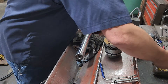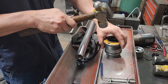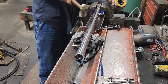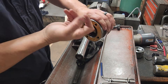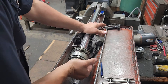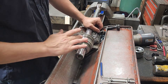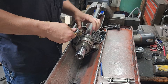Lastly is the wiper — we'll take and start it there and hammer and work it all the way around. After all that's done, we'll get some grease and put it in the gland. Start back on the rod, give it a pump there, and push the gland on. Get a little more grease and put it on the o-ring and backup. I've got some anti-seize here that I'll put on the threads — I'll put this in about three spots so that when I turn this gland in it'll screw into the threads.